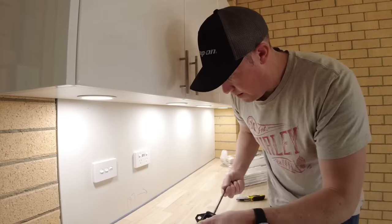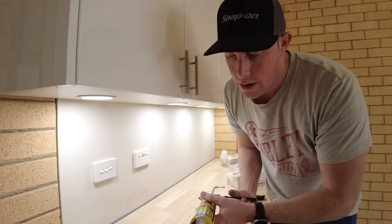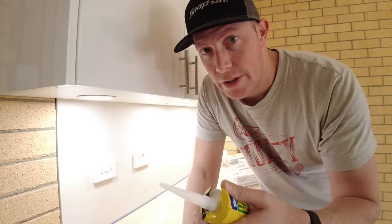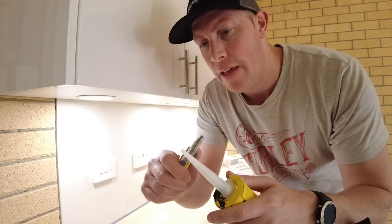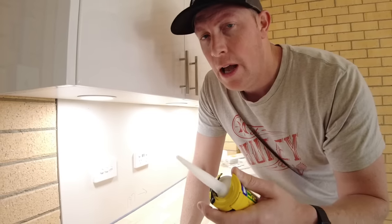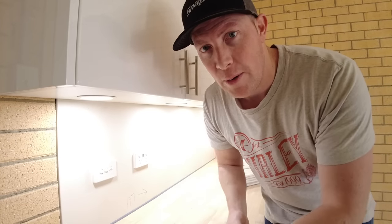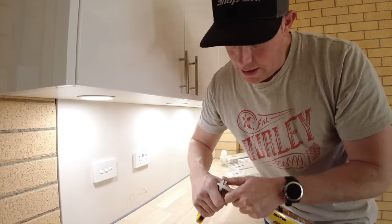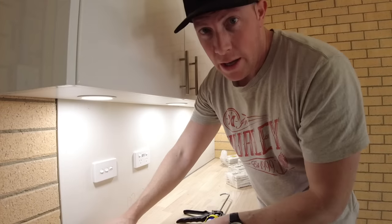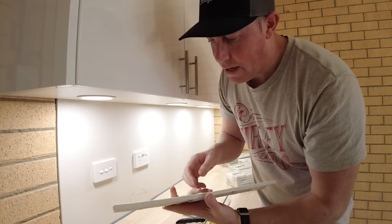So let's have a look at putting this stuff on the wall, and when we come up to a cut I'll show you how we do that. Let's get our Liquid Nails Landscape prepped and ready to go. With caulking guns, because I want to use this sparingly, I'm going to cut the nozzle relatively short — maybe a centimeter and a half — so I don't get carried away and use a whole tube on the first row and not have enough to finish the job.